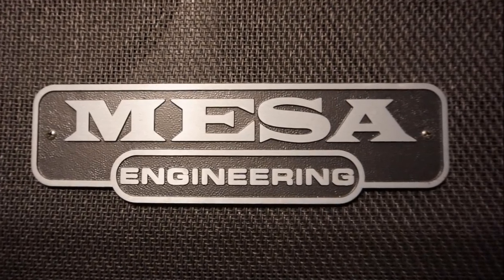If you were just to run a signal out of your preamp pedal like I have behind me, it's going to be pretty quiet — to the point where you can basically not even hear it if you're running it through some type of passive system like headphones, depending on their impedance, and especially large speaker cabinets. So that's where the Baby Bomb comes in. This is basically your equivalent of the power amp section on an amplifier. Pair these two together and you have a functional amplifier on your pedal board.